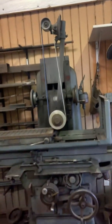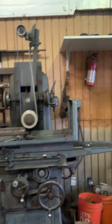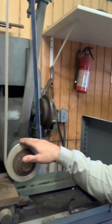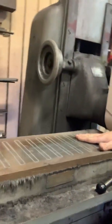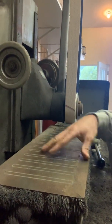This is my surface grinder. It's old and it's really heavy, but it's super cool. Normally it ran a stone — a stone would actually be more accurate if I was making stuff for NASA — but I run an aluminum wheel with a belt that comes up to an idler assembly here. Got an arm that comes up and holds that idler assembly. This is an eight by 24 magnet — eight inches wide, 24 inches long. Most of them are six by 18, maybe even a little smaller. I got lucky finding this eight by 24.